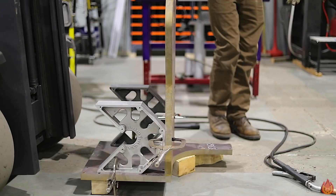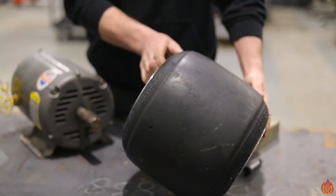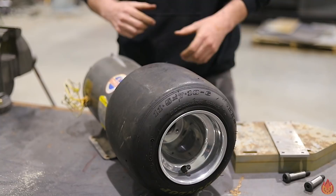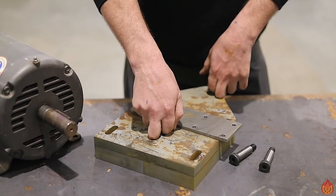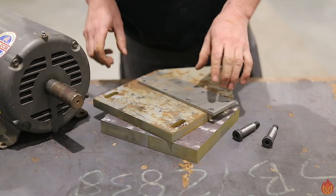Here's the plan for driving the belt. We're going to make a hub adapter and attach it right to the shaft — direct drive off the motor. The motor mount is beefy, way overkill, but the best material to use is the material you already have. We've got three-quarter inch plate and inch and an eighth plate, and the motor is going to sit something like this.